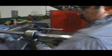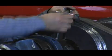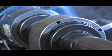The BB5000 through-bar design allows the rotational drive unit to be mounted anywhere you have a bearing. It's convenient to mount the drive and axial feed unit together, but in work areas with restricted clearance, the drive and feed can be mounted separately as well. Since the drive and feed are not limited to mounting on the end of the bar, the BB5000 can often be used in areas that other boring bars can't.